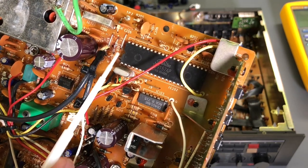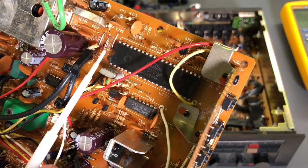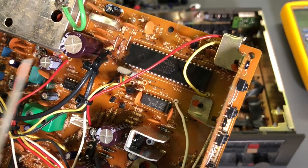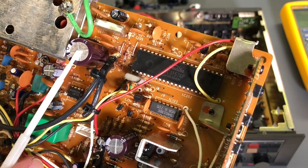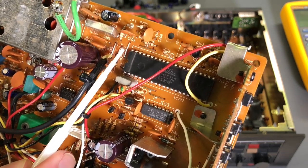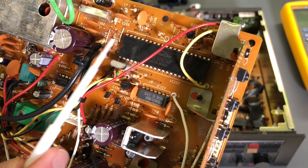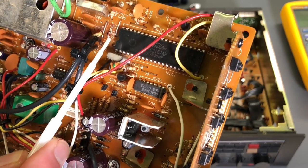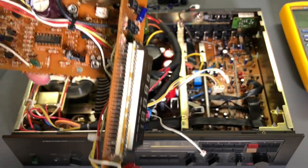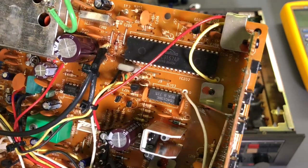Diode 202 — a glass body diode — cracked in half, probably during cleaning. It's very fragile, so that was replaced. This is the memory hold-up capacitor that powers the memory in this chip. The conductive glue around this area was acting like a resistor across that diode, so the memory was not holding up over the long term — the capacitor was effectively just discharging around the diode. The purpose of the diode is to block that discharge path. Some jumper wires on the circuit board also had corrosion and were all replaced.